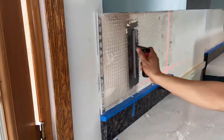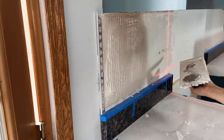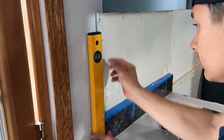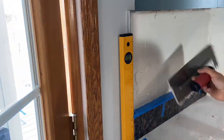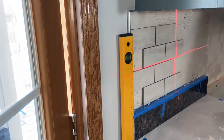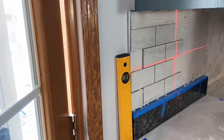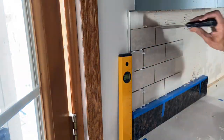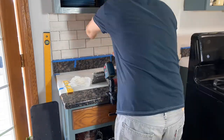All right — enough talk, let's do this. Laying the mastic and tile. I chose mastic because it's a pre-mix, which is easy for an amateur like me. This isn't a bathroom floor that constantly gets wet — in those cases you'd want to go with thinset. Here we go laying the mastic and the Schluter, pushing the tile in with the little spacer pieces I cut earlier. I went with a laser level — for a stingy person like me, it was an absolute must.